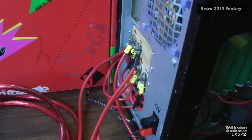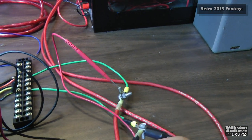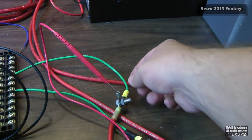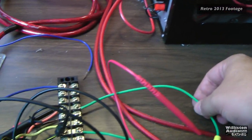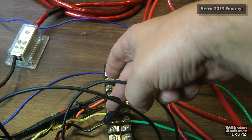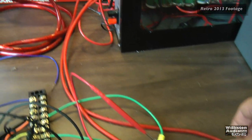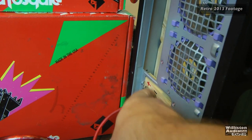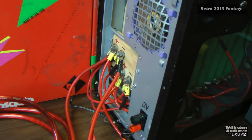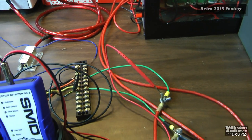The way the resistors work, I have them set up sort of like speaker leads coming off to ring terminals, which then go into 12-gauge wire. We have the Orion 225 HCCA hooked up here and we're testing bridged output. I can rewire this with jumper wires to reset the ohm load. Right now it's set at 2 ohms and we're going to do a 2-ohm mono demo shortly.